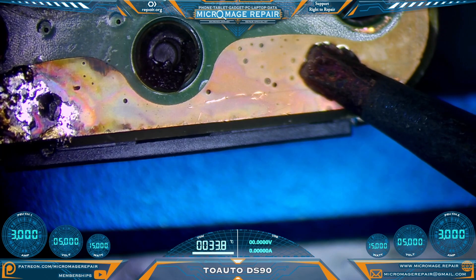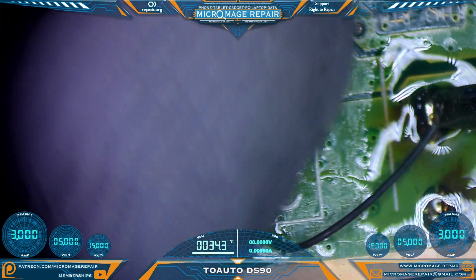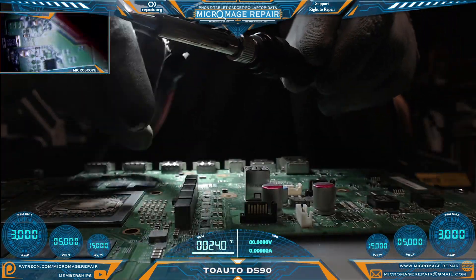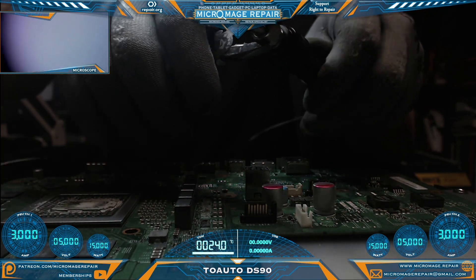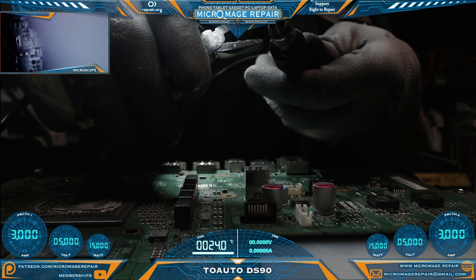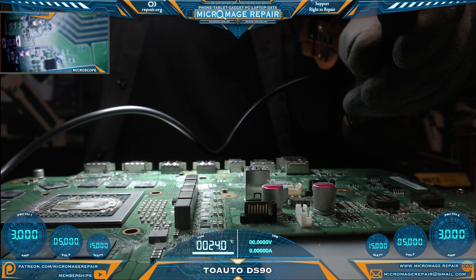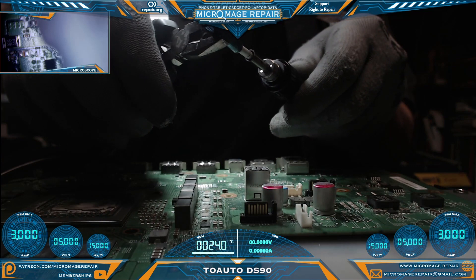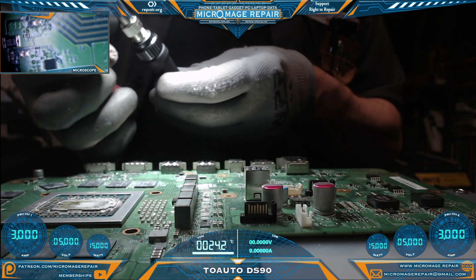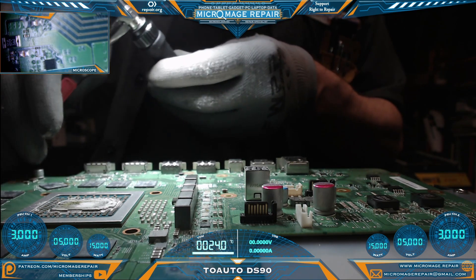Let's go to this one and see how quickly we can get it to heat up. Not bad. It does get there — a little shocked even. Let's hit the anchors and see if we can feed solder onto that. Yes, certainly can. Now, because it's warm I'm going to use a tool — this is one of the drawbacks of these irons, you do need a tool. It's going to be quite warm after soldering, so you'll have to carefully remove the shield and find a place to set it before putting a new tip on.